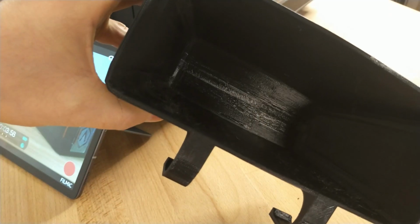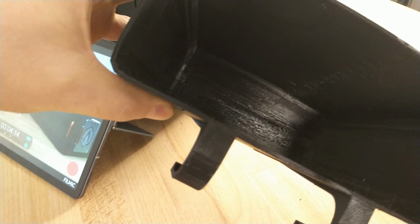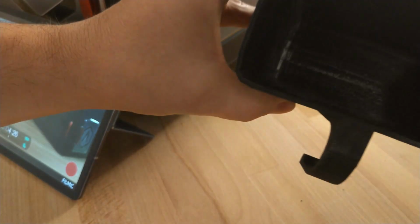Yeah. The bottom where the support structure was is fine. There's a little bit of loose strings, maybe, no imperfections. It's a rough surface because of the support structure we had in there, but it looks okay. But the temperature wasn't right here. 255 was too high for this ABS material. It just strings, have all these strings in there, all these small little hairs.